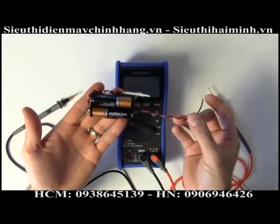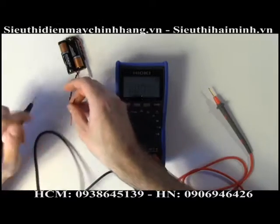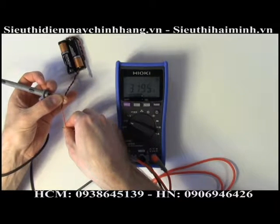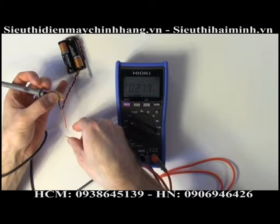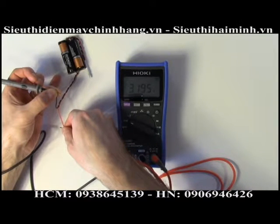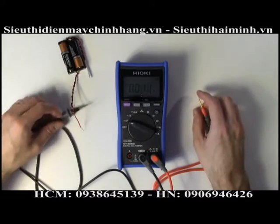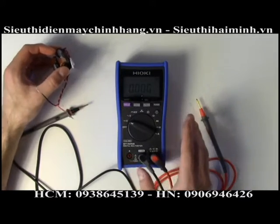Here's another little rig — just a pair of AAs in some holders taped together. Let's see if we get any different results with a slightly lower voltage. You can see we dropped into a lower range, so the bar graph is halfway across, and we're measuring 3.195 volts. This meter is specified for five updates per second of the screen. This is a 6,000 count meter, which is really not bad for the price range. I think this meter in its basic specs and functionality gives Fluke and Agilent a run for their money. I believe this is better constructed as well — I just love the feel on this meter.